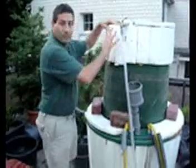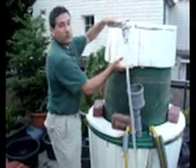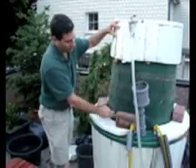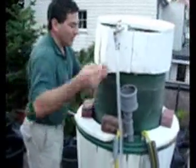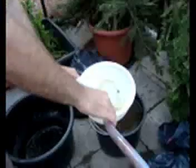When you built it, it was an empty space, but we couldn't get the gas out. So I've now filled this entire area up with styrofoam with a tube going down so that the dead space is filled. That leaves us with 200 liters of gas each time we fill this tank. And the extra fluid that comes out when you pour the food waste in comes out here.